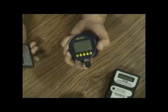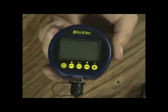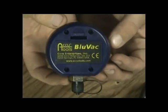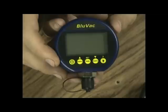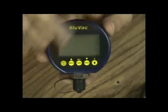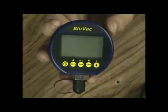The Blue Vac is the newest micron gauge on the market that I know of — built by Accu Tools, a company in Florida. One of the really nice things about the Blue Vac is it's 100% temperature compensated. Any time the temperature changes, the gauge updates its reference to stay accurate. It also has an alarm — you can set it for, say, 500 microns, go do something else, and when it gets below 500 microns it'll sound an alarm.